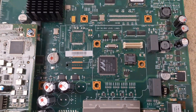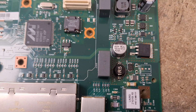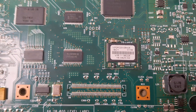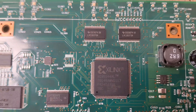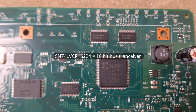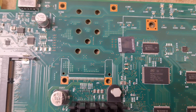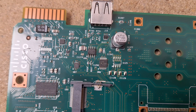Here's the Cisco switch - looks like a Marvell network controller. There's a little Power over Ethernet power interface, a couple of RS-232 chips, some buffers, an FPGA, more buffers, LVC 1637-3A - I think I've seen those on aircraft avionics - a flash chip, the main RAM and a few bits.